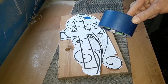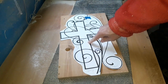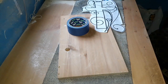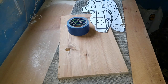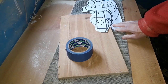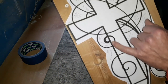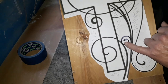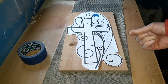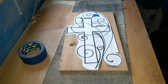First we need to get the template on. I want to use carbon paper and draw around it because we're going to do a lot of scroll saw work, and this is the only section we're going to route out. I'm going to put builders tape along the base so the paper comes off easier at the peeling and sanding stage. Then we'll cover with painters tape, spray on some glue, and stick the template down. Then we'll drill pilot holes in every section we're going to remove - all those shaded areas - so we can feed our scroll saw blade through and attach it to the saw.